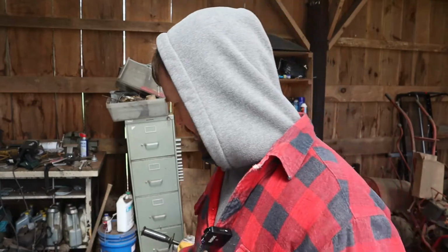And just to be thorough, what I have here is one of those cup wheels on a 4-inch angle grinder. Again, you can get all this stuff locally at whatever hardware store you prefer. The other thing I tried was a standalone wire wheel on what is effectively a bench grinder, and that worked okay in that it took away all the time spent clamping, but it was still not quite as safe and efficient as this so far, in my opinion. Sometimes the mower blade would catch on the wire wheel and bog it down, and when I'm near it, there's a possibility of getting my hand hit by the wire wheel, which I try to avoid, but every now and then it happens and it's really uncomfortable.